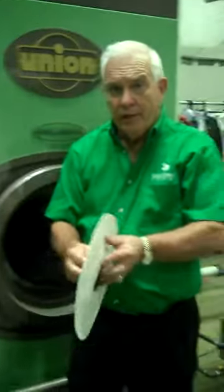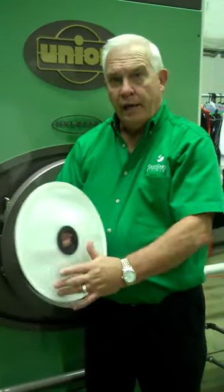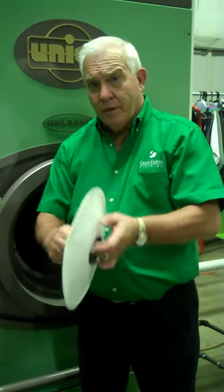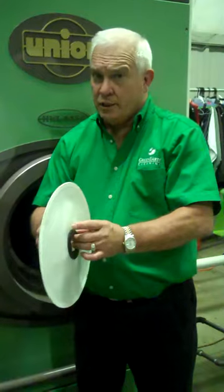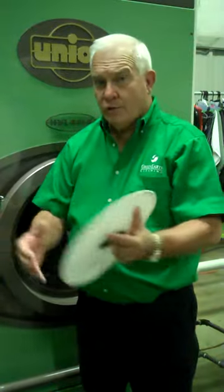This is a spin disc — there are 26 in this particular machine. The pre-coating occurs when the clay is adhered to the outside of the spin disc. When we do the pre-coating, the spinning and dropping centrifugally takes the ACF and the solvent off the spin disc.